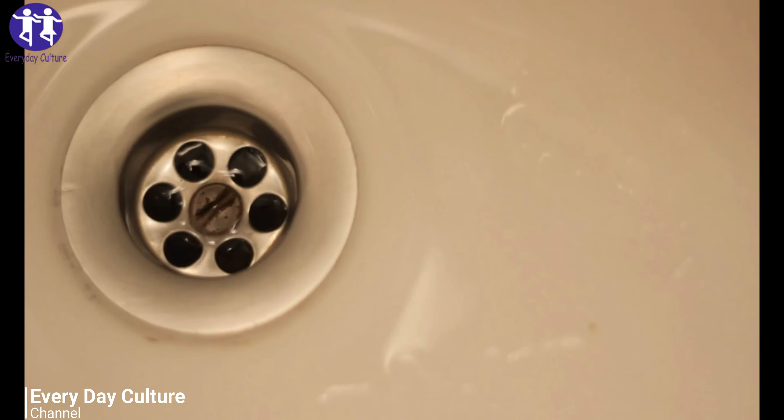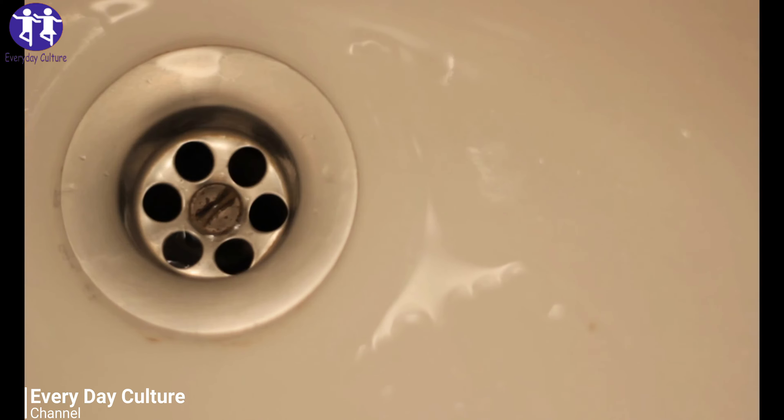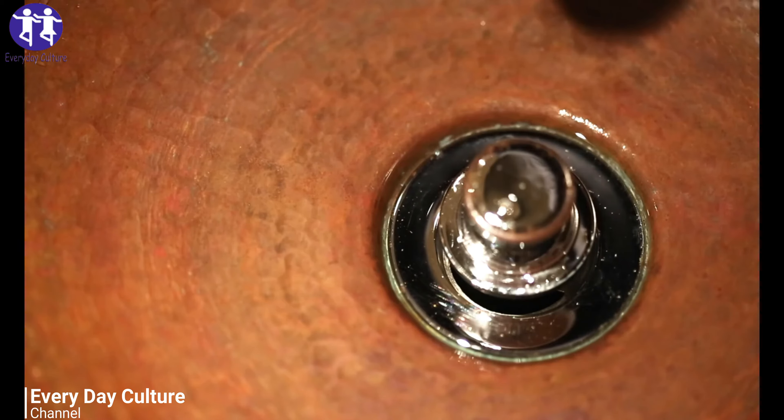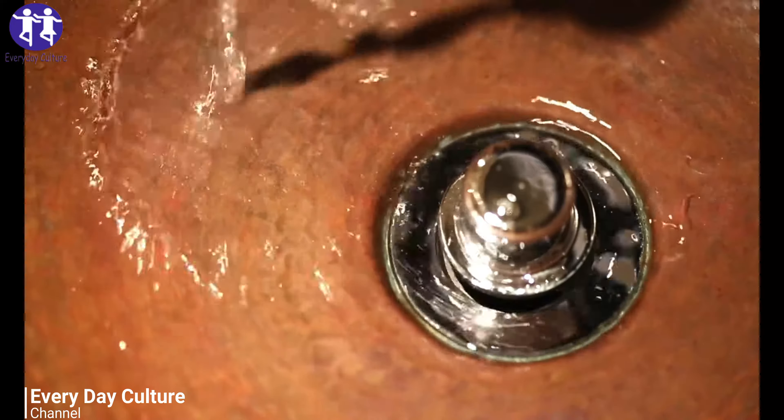Number 6: Use a Plunger. There are two types of drain plungers: for toilets, you should use a flange plunger; for sinks, showers, and tubs, you should use a cup plunger. If your drain is completely clogged, remove the drain stopper and fill the sink with enough water to cover the plunger's suction cup. Then proceed to plunge using the same motions as you would with a toilet. The abrupt changes in pressure on both sides will eventually get the blockage dislodged and carried away.